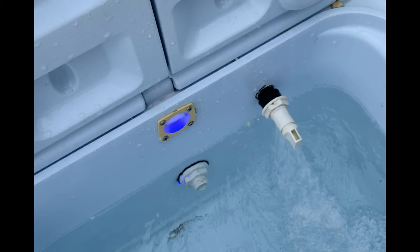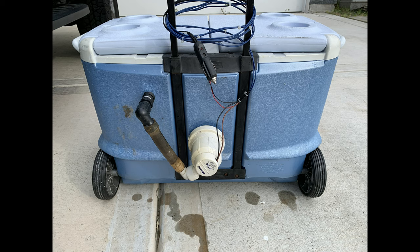Here's what I just described in real time — you can see the intake at the bottom and the nozzle spray up at the top. Just make sure that with the light you don't go all the way through — that's just to make it flush. Here's the back side of the cooler, everything's installed and fully functional. You see where the aerator pump is already set in place, the wires — black with black, red with red. I didn't have another color so I used the blue wire I had. It's about a seven-to-ten foot section of wire, just enough to move it around the boat. The riser piece is on the left-hand side; the only thing I hadn't put in at this point was the hose clamps — once I added those, the leaking was gone.